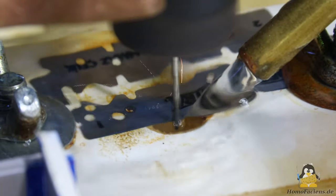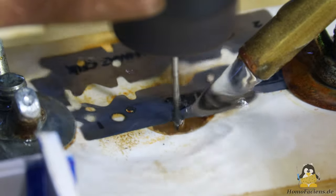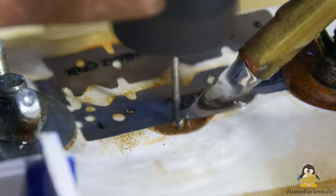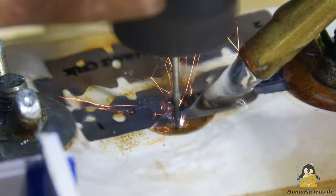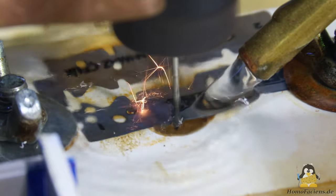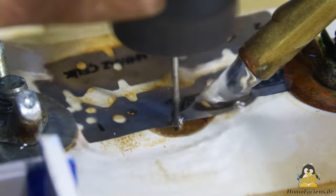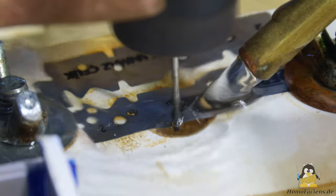As the next step I have to write the software to be able to process different paths with the CNC instead of just drilling holes. I will also explain why there is a second diode to detect short circuits and how to block them with a second MOSFET. The software of the boost converter and CNC offer many starting points for optimization. There is more about EDM in the upcoming video of this series and also on my HomoFaciens.de pages.